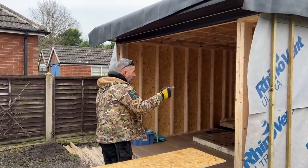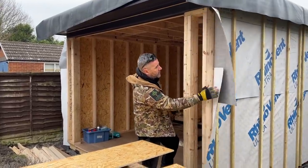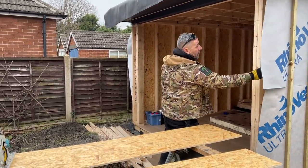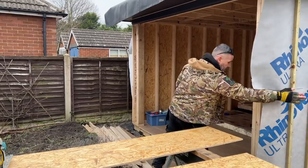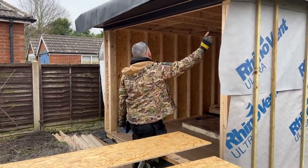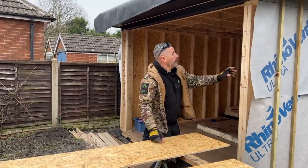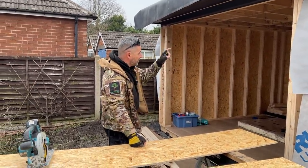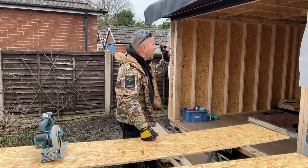We're pretty good on the back with the OSB and the double battens. We need to double batten the side still and we also need to get this front OSB'd as well. So I'm going to cut the cheeks now — cut two upright cheeks there and bring it down so it's the same height as the other one, covering the shoe, and get that fixed. I've also got to fix a piece of this steel as well. I'll cut these two bits down, get them fixed on time lapse, and then we'll drop back onto this bit above the steel after I've cut it.